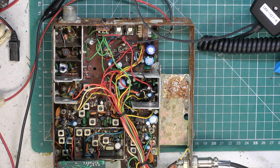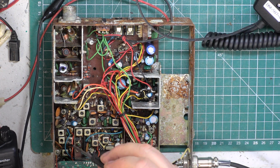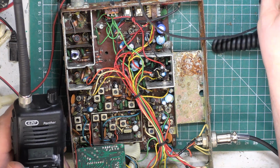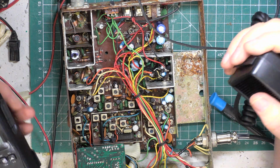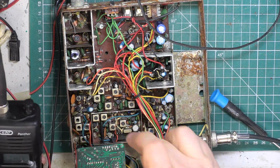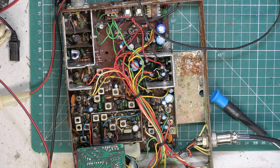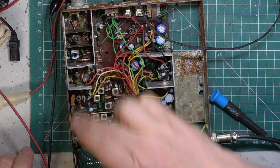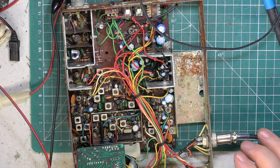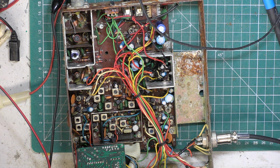So we'll switch our monitor receiver on. Because if this is producing the frequencies, then we will hear it in our monitor receiver. So I'm on channel 20. Testing 1, 2. Well, there you go. So it is generating the frequencies. Well, in that case, I'll look for a scrap set, which is scrappier than this scrap set, and we'll take a couple of transmitter parts out of that. And, wow. To be honest, once that's working, you're a third of the way there.